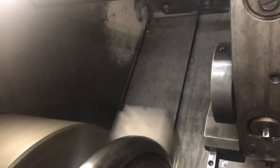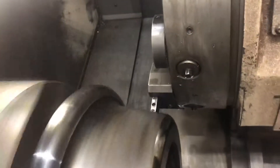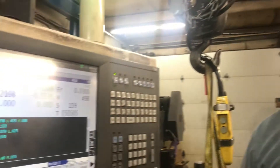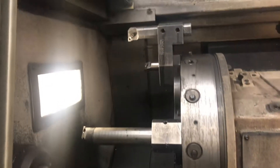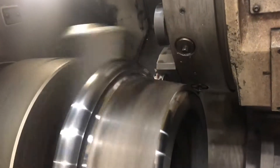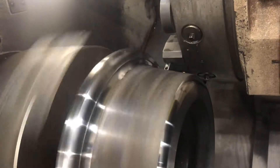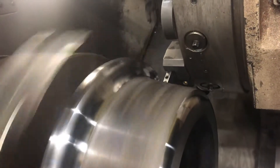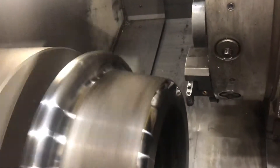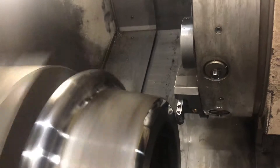So how many passes do we make to finish it? Seven passes — so we're making around ten similar moves to get that material off. CNC lathes are super accurate and that gives you the ability to make these fine cuts. I think you guys have met Joe a few times — he's the lathe guru here; he writes all his own programs, makes his own CAD drawings, and gets the machine set up. You can see he's cutting the radius at the bottom of the land right there. It takes a little pass, then zips right over and makes another pass — you don't have time to get out of the way.